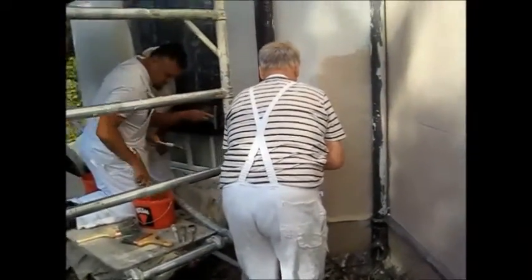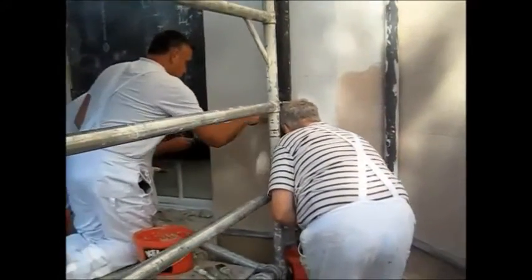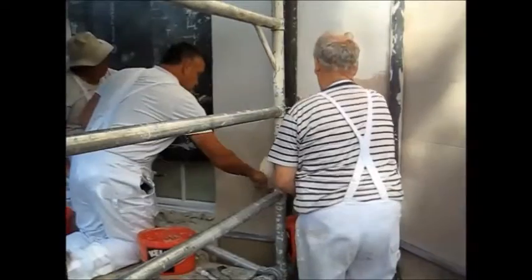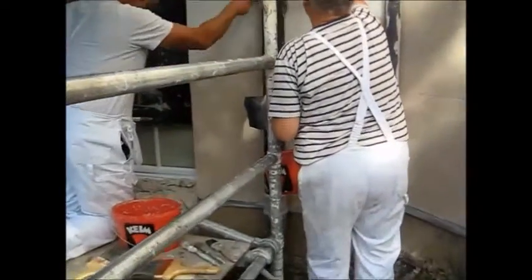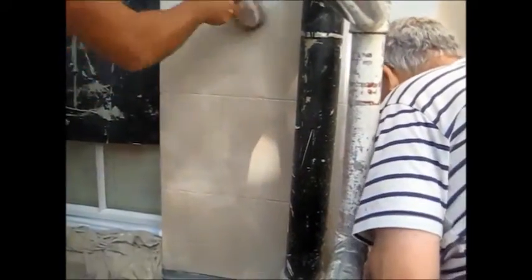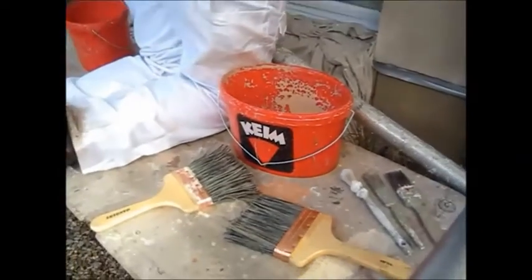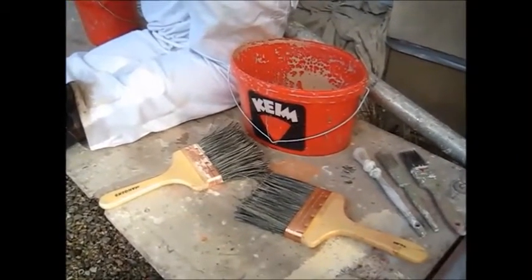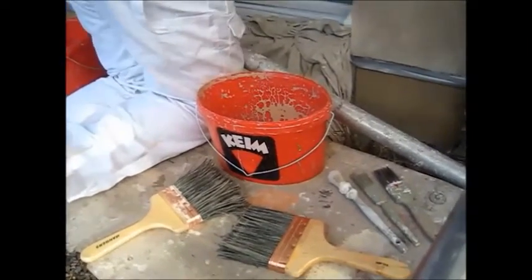This is not a job you can do with just one painter — you must have at least two, and on a large wall like this, four is ideal. Keep wet brushes, but have a couple of dry brushes handy just to take away any runs. Stipple them if they've started to dry so that you don't overlap.